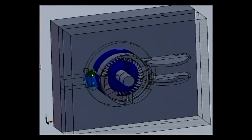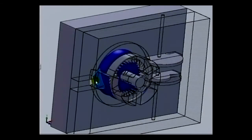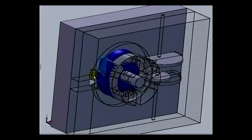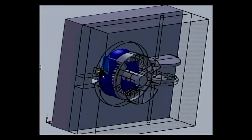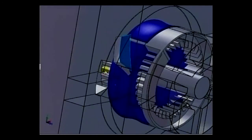Once you get up to here, your exhaust gases are at that point pushed out from the prior cycle, so this top side is now filled with new air charge and it starts compressing. Now notice as you're here, these little paddles — there are pretty large paddles — and you have air and fuel perhaps moving in this area and exhaust moving in this area.